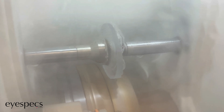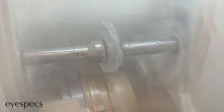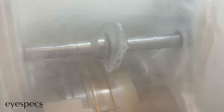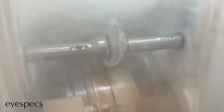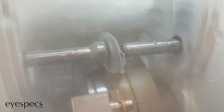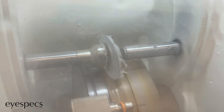What's happening right now is the lens is actually being cut into the shape of the frame. As you can see, the lens is getting smaller and smaller and it's starting to look more like the actual lens shape. The lens then shifted into the middle part of the wheel, which creates a little indent in the middle of the lens so that it'll fit perfectly and actually stay there. You can see that little line in between — that's what it's doing right now.